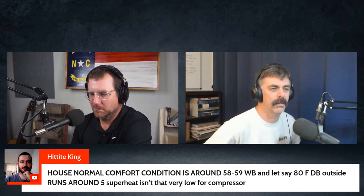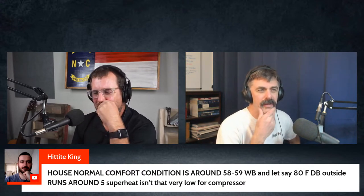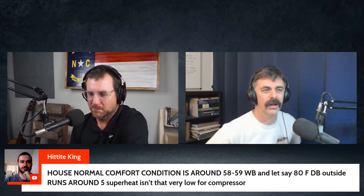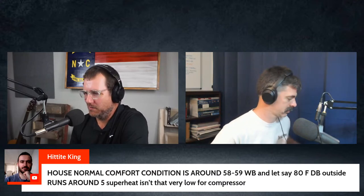I wish I knew a dry bulb temperature to go with that. Let's say this. But 5 degrees superheat. Yeah, what kind of unit is it? Did he say that anywhere? He had something else he wrote. It says, question, can we say piston systems, normal operating indoor wet bulb 58 to 59?